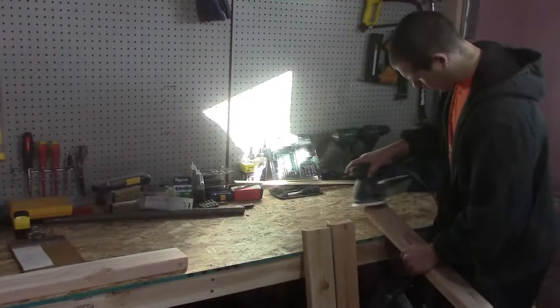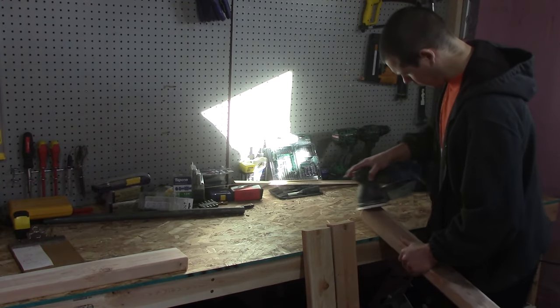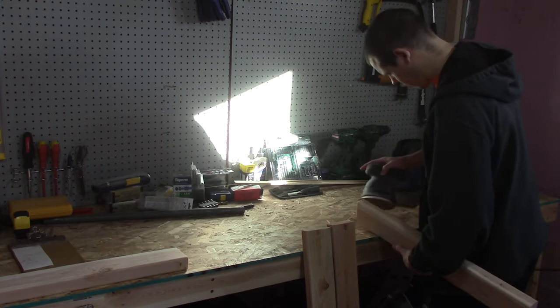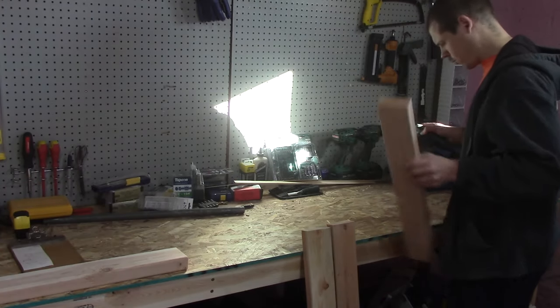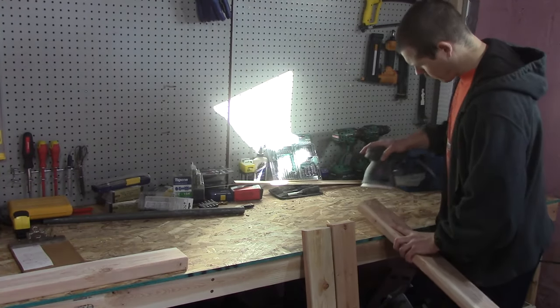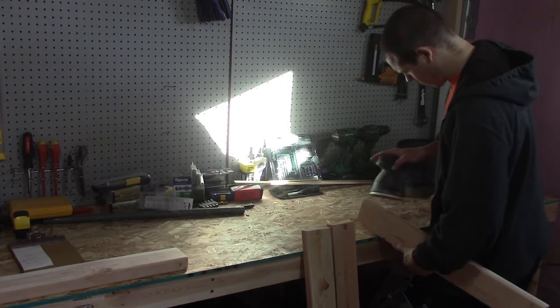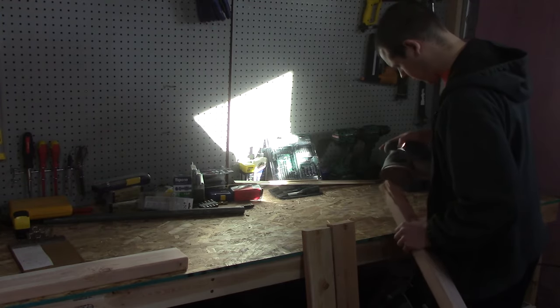After cutting the boards, it was time to sand everything down to remove any sharp edges and corners. I'd hate for somebody to sit down on my sofa and get a sliver or scratch. Some boards, like the rear uprights and cross pieces, don't need to be sanded as much as parts that will come in contact with people, like the armrests. I thought about using a roundover bit in my router on all the exposed edges to make it smoother, but decided against it. This build is all about simplicity and almost a rustic look.